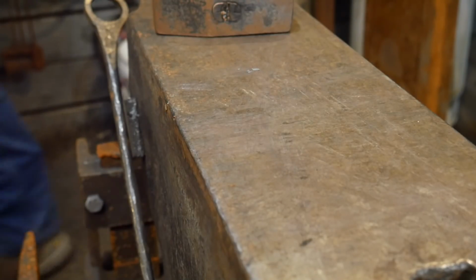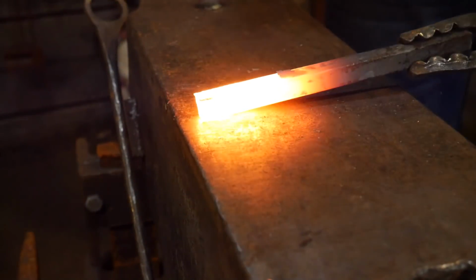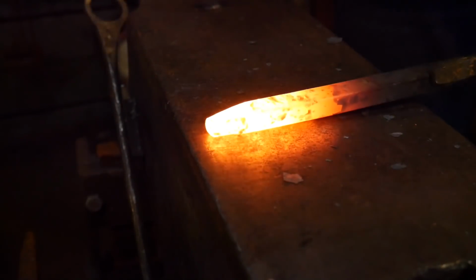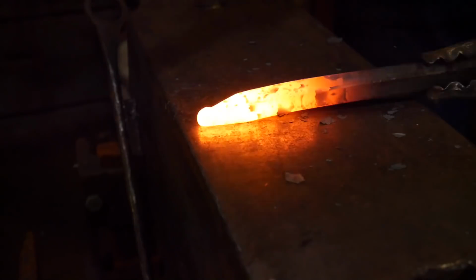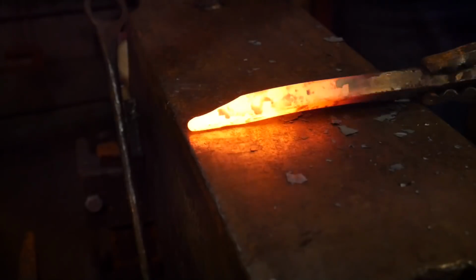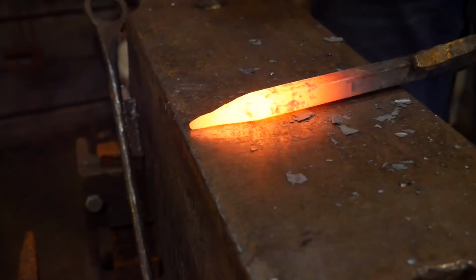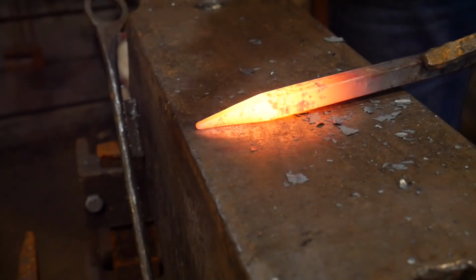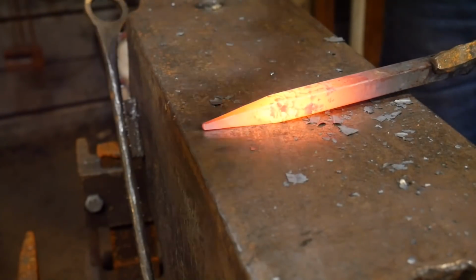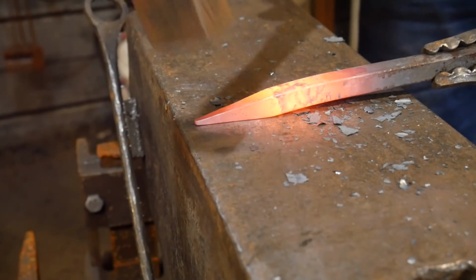Okay, we're going to start first with the non-burnt steel. Heat it to a proper forging temperature, and we're going to forge it out to just a simple taper. I want you all to notice how clean it looks, how the surface of the material kind of refracts light when you've got a good clean forging going on and you've planished out all your hammer blows.